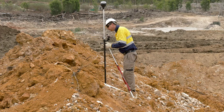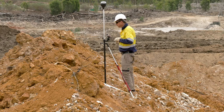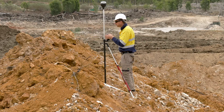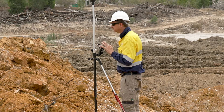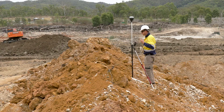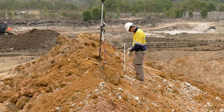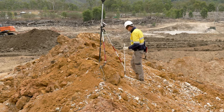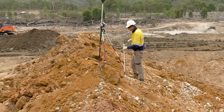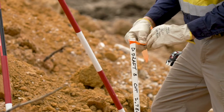I'm going to level the pole up and make sure I'm still within spec. I'm 11mm off my target and the cut value here is 2.78m. Before I put my stake in, I'm going to jump out of this project and go into another project to collect a point, so I've got a record of exactly where I put the stake and what the elevation was — just good record keeping. We've got a cut value of 2.78m here, so I'll mark my peg up before I bang it in the ground. It's always a good idea to keep an eye on how far your survey pole goes into loose material — you'll need to compensate for that on your cut values. Put it in far enough that it's not going to move and flag it up so the crew can find it easily.